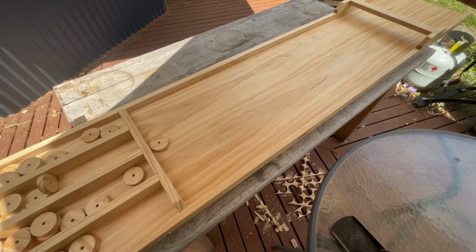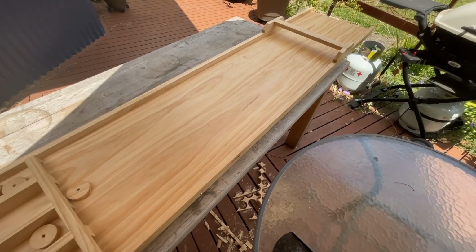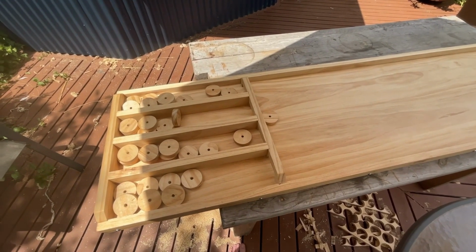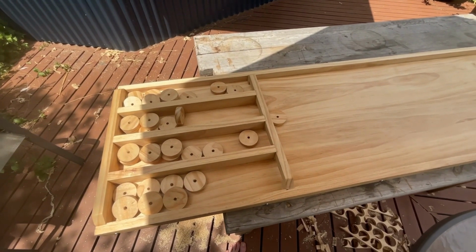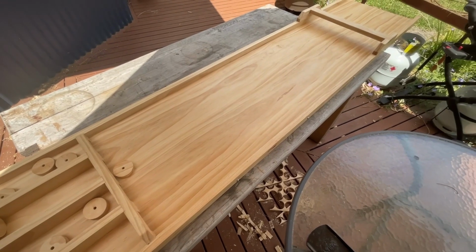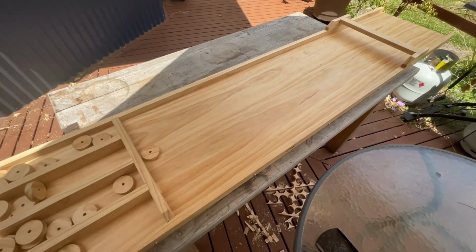And it was glued with clamps and timbers across it, straight edges across it, to make sure that it was as flat as possible when I started, to minimize the amount of effort to then have to utilize to plane it down. Now, outside of the hand saw used because it was just quicker than setting up the table saw with a jig, used a hand router to route out the notches, cleaned up with a chisel, then the plane. The plane came into play for the largest part of building this, of making sure that surface was as flat as possible.